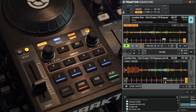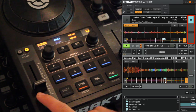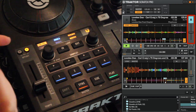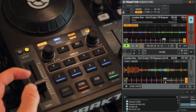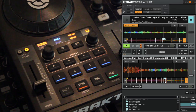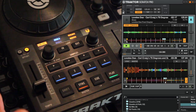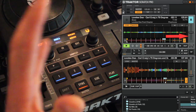But what you can see is the fader on the screen is in center and the fader on the hardware is a little bit low of center. Now that's what this light is telling us here. This light is saying you need to move the hardware fader up in order to align it with the fader that's on the screen. Now what happens if I just go ahead and touch this fader is the software fader will jump to the position of the hardware fader and it might sound terrible.